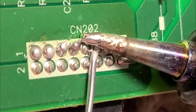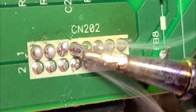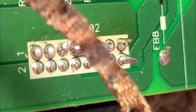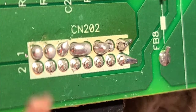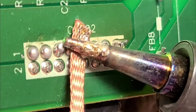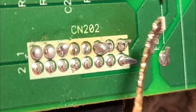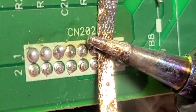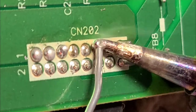I don't have the best soldering iron right now — my tips are terrible. We've got two pins bridged together right there, so I'm going to use what's called solder wick. This is just a strip of copper — you lay it down, it heats up the solder and soaks it up into the weave. You can see it going up through there — no more solder there. We still got a little bit left on that one, but we can continue.